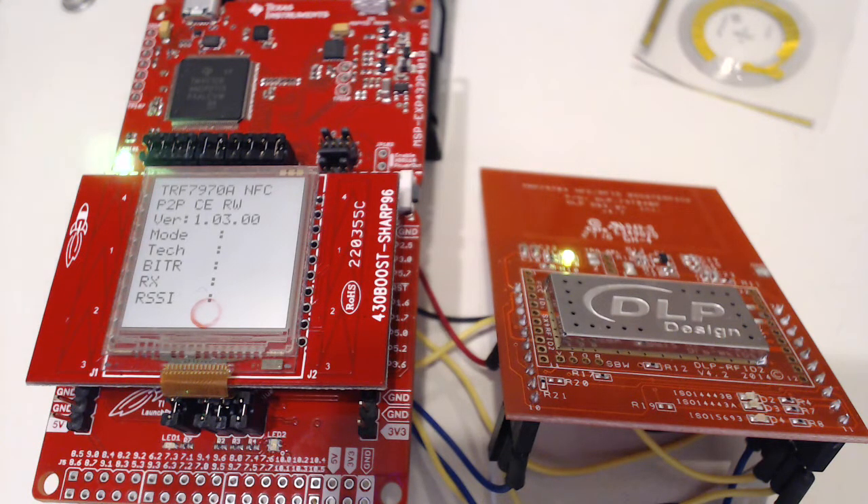There's a project example that comes with this — the P401R TRF7970 all NFC modes. There are some MSP432 examples inside there where you can basically check to see if you have an NFC signal, and that's about it. They did have some MSP430 examples with another board that had an LCD display, but those weren't enabled for this, so I've actually hacked that as well. Now I can get that information, which shows the model number of the TRF7970A and some other information, along with the firmware version: 1.03.00.